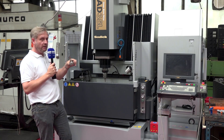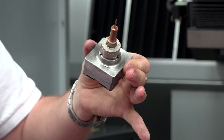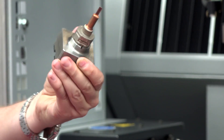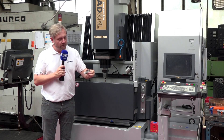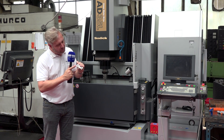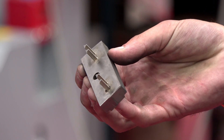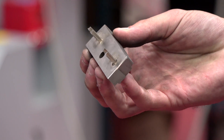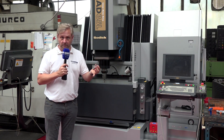But what are they manufacturing? Let's look at the electrode that they're making in-house. This one's relatively straightforward, but they've got a whole suite of them that they've built up, and any electrode you need — that's not a problem. But more importantly, what they're manufacturing: you could potentially mill it, but not with these radiuses in there. If you're looking at those tight angles, straight 90 degrees, you're never going to mill that. EDM it all day long — fast, easy, accurate — and also other components that they make as their own tooling in-house for their plastic molding.